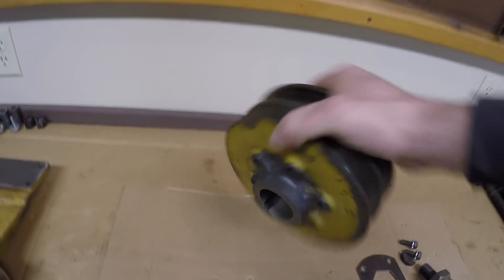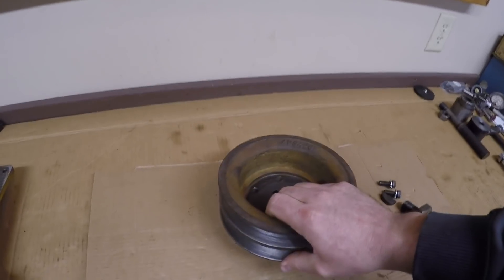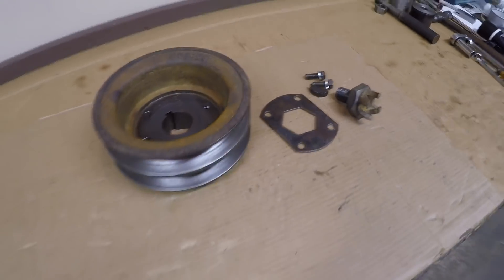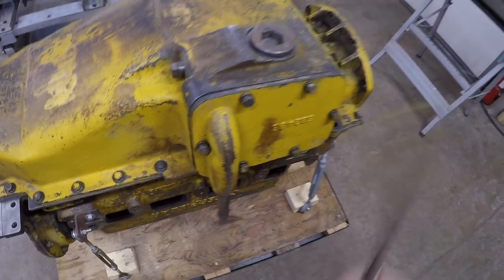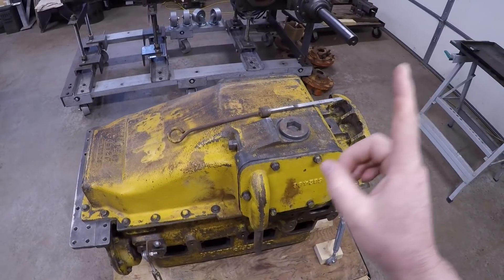So why did I spend so much time talking about a crankshaft pulley? Because it's one of those first-generation pieces that survived. Updated components were released to supersede these and make the seal perform better, but 1113 was a fairly low-hour machine and it just never really got any of the updates. That's kind of what I like about it — it lends to the cool factor for a tractor geek like me that can get into all these little minor detail parts and just analyze them. It's kind of like this first-generation dipstick with the old marks on it.